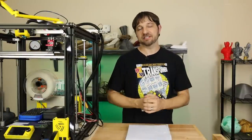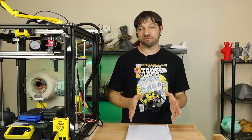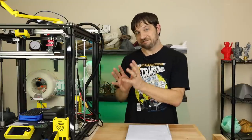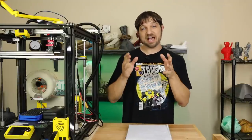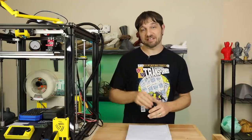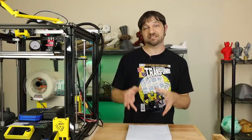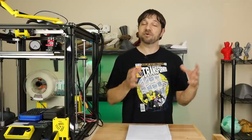That's it for this upgrade. If you're looking for any of the components I used in this video, please check the description below — I'll have links to everything I used so you can grab them for yourself. If you're looking for my firmware, I'm going to have it in three different formats: first, a pre-compiled binary that you can put on a micro SD card as firmware.bin and drop into the main board — when you power up it will flash directly to your printer. If you need to do your own compiling or configuration, I'll have the configuration files in a convenient zip, or you can download my entire source tree from GitHub.